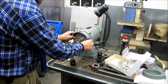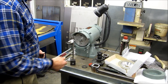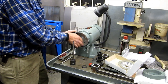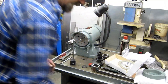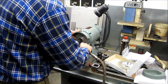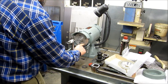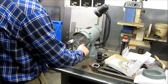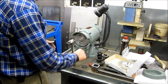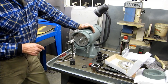Even this rock isn't extreme — it's like two — but as soon as I tighten this up, I run into this same problem with pump shafts: that sleeve, if your stack-up isn't 100% straight line, we're back to 18, 19 thousandths. Actually a little bit less, maybe about 15. So somehow I've got to get in there and get that sleeve pulled off of there.